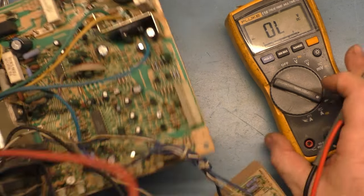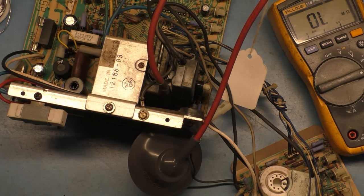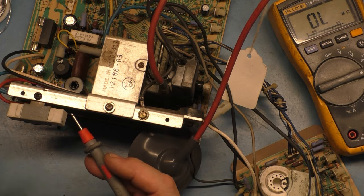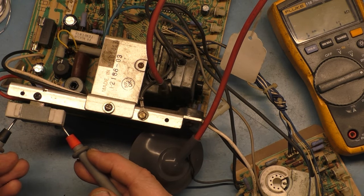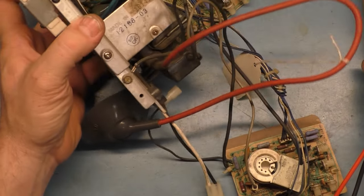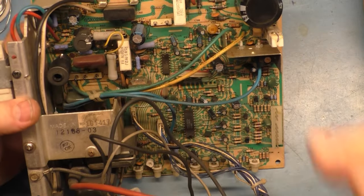We can check our voltage regulator by simply going across the B-plus resistor. We should get, I believe, 220 ohms on the 19-inch. The 25-inch is 180. So if we get 220 ohms, our voltage regulator should be okay. And we get 2.8. So our voltage regulator is shorted, and our HOT is shorted. Not unexpected with the coil being out of circuit. So...